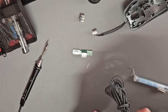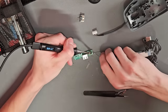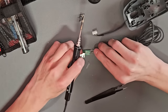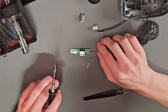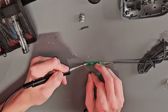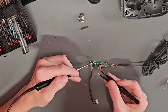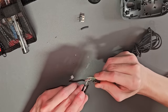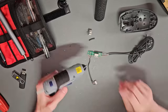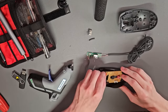I noted the order of the wires when I removed the cable. Your hub's likely going to be different — there's no standard for this. The nice thing is there is a standard for the actual USB male port. In this case it's red, white, green, then black. I'm going through making sure the thin insulation isn't compromised, and adding some hot glue so we have strain relief. When we start fiddling with the placement inside the mouse, we're not going to break off any of those connections we just soldered.